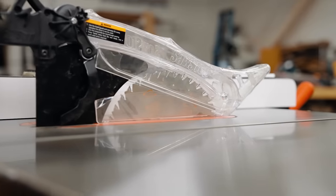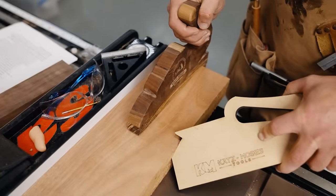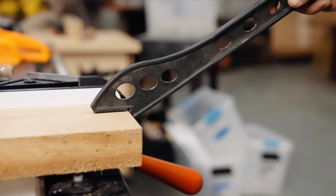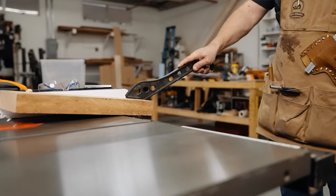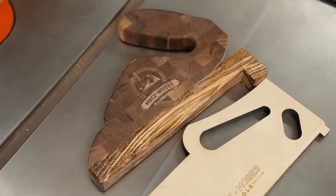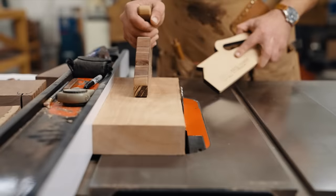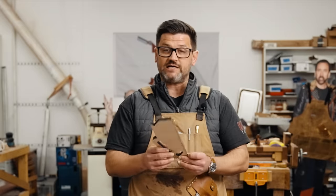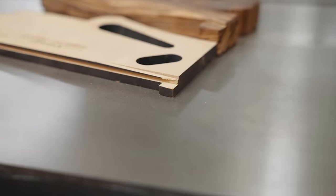Also, the top of the guard, which usually has dust collection in it, keeps the board from being thrown up towards your face or chest. Second, you always want to use a push stick on a table saw — there's never a reason not to. You want to make sure you're not using the bird's-mouth-only pieces that come with your table saw, because they don't have a lot of top support, meaning your board can still lift up. Instead, use something with a long portion that keeps the top of the board down, and use a second push stick to push it against your rip fence as you go. You also want to check the heel of your push stick, as these get chewed up on thin cuts and could potentially break while pushing a board through, leaving it unsupported.